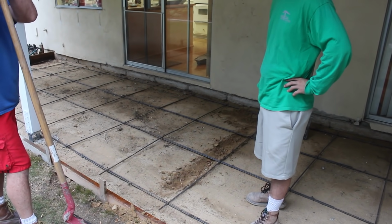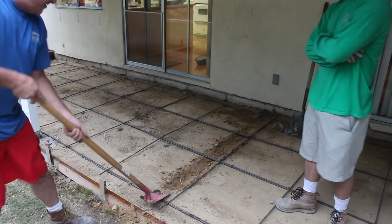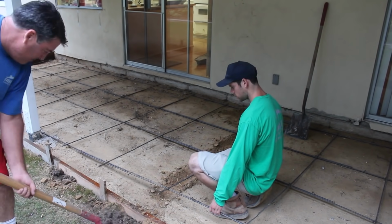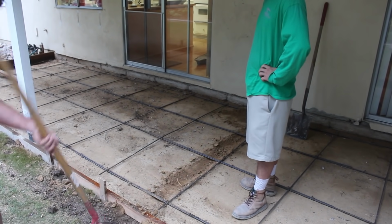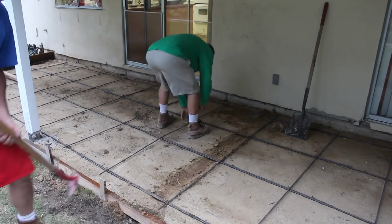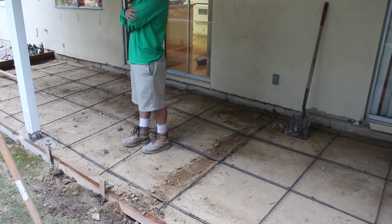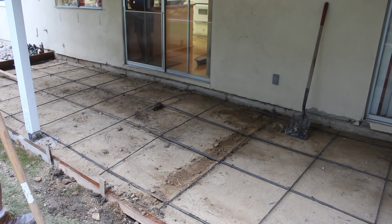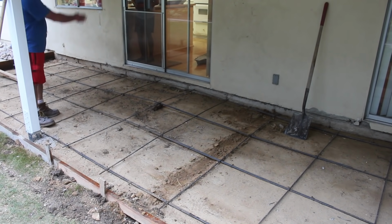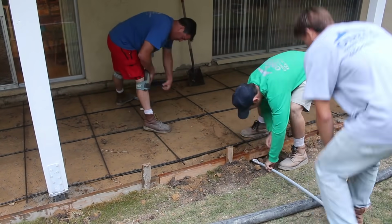We're just getting ready to pour, and then I found out that we needed a conduit for future potential into the backyard. That outlet that's on the back of the house there, that could potentially be popped out, and you could drop in some electrical and get into the backyard for maybe a fountain or whatever else you might want for power in the backyard. So we had to make a quick run to the Home Depot, or might have been Lowe's, it was one of the local hardwares, but we've got some conduit, and we're just going to do some 1/2 inch here.